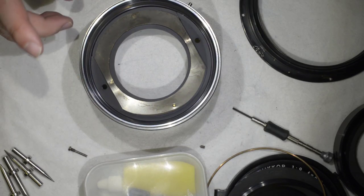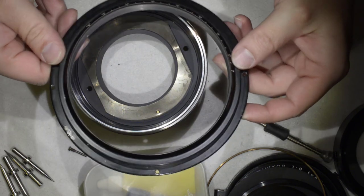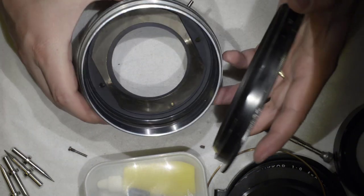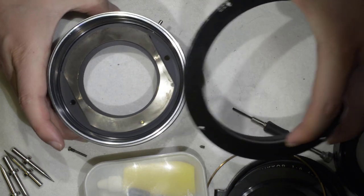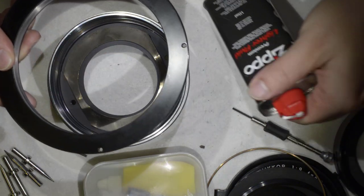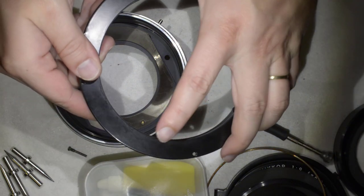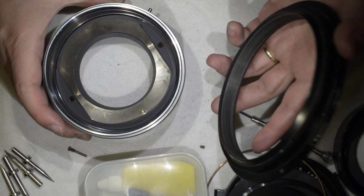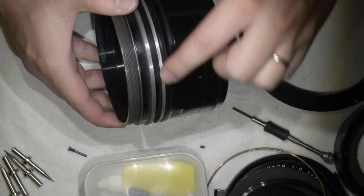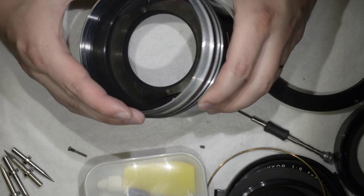So hello friends, at the end I managed to remove the aperture ring which I have here. To do so, as I told you before and as I suspected, it was a threading, and here you have confirmation of that. I added some lighter fluid on the rim here, and then it became soft enough so I could unscrew it. This is the shape you have, and then you have the threading and the opening we just saw before,